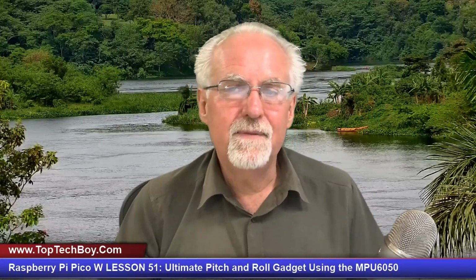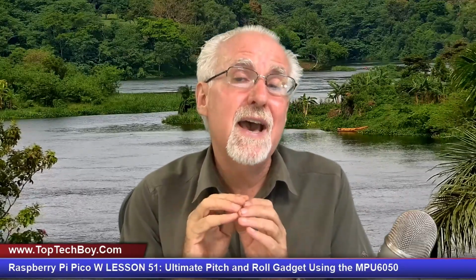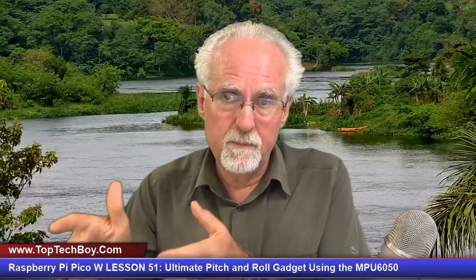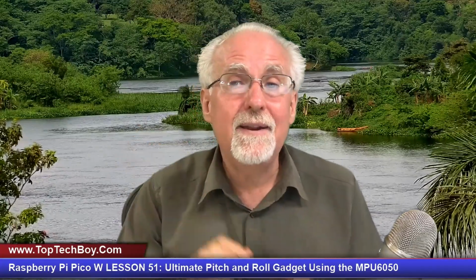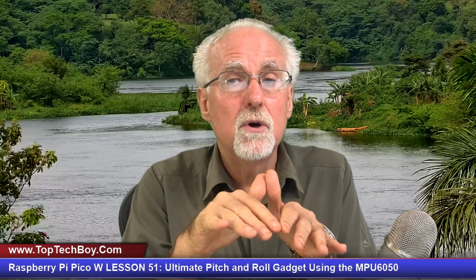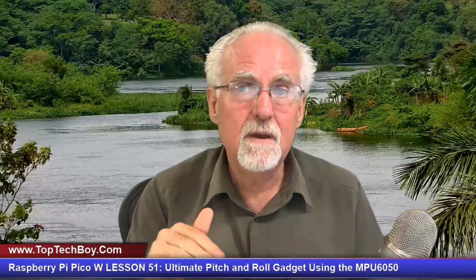Okay, hopefully you guys got this, because really it was just pulling together the stuff that we've learned in the last lessons. The homework assignment was to take the work that we did last week, where we were getting the kind of ultimate measurements from the MPU6050, right? We were measuring acceleration, we were measuring from the gyroscopes, and then we were fusing the data together to get something that was fast, accurate, and low noise. And then we added the cherry on top of the ice cream by also pushing out those long-term steady-state drift terms. So we have something now that is quite possibly about the most accurate measurements that you can get from the MPU6050 for roll and pitch. Okay, so we got all that.